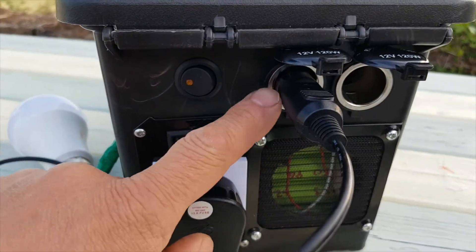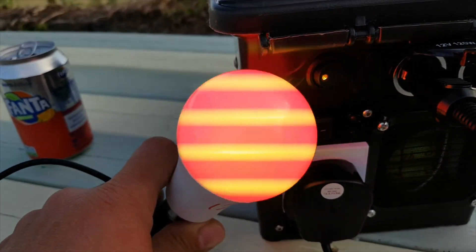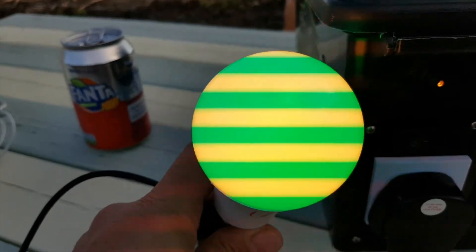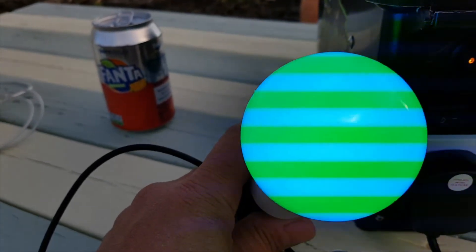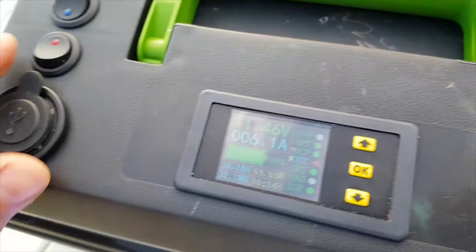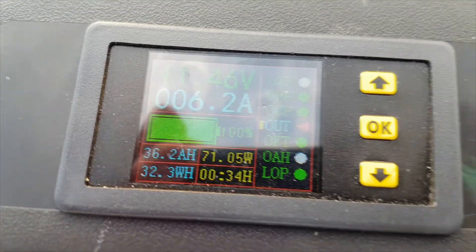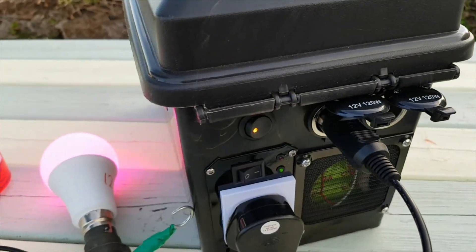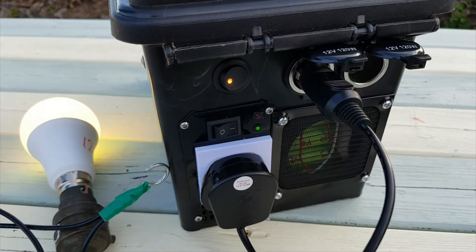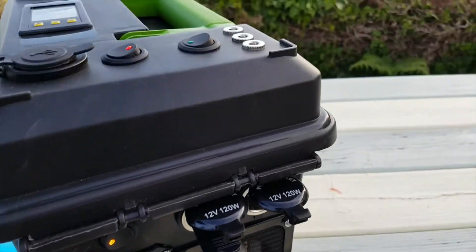This output is boosted to 13.4 volts — switch it on and it runs my colour-changing light. It doesn't look like that in real life; it's just an artifact of the camera and the PWM of the RGB lights. All outputs are individually switched. With everything on, it's drawing a whole 6.2 amps, which for a 35 amp hour cell pack is absolutely nothing — there's not even a need for the cooling at that level, but it's there for higher demand applications.